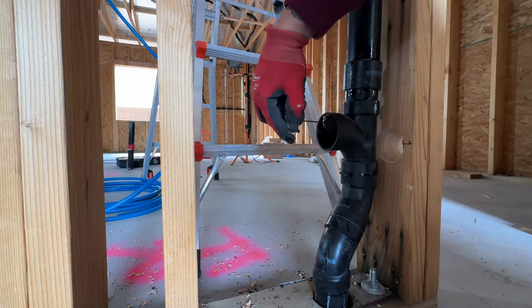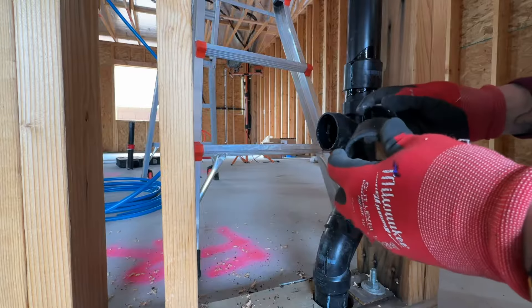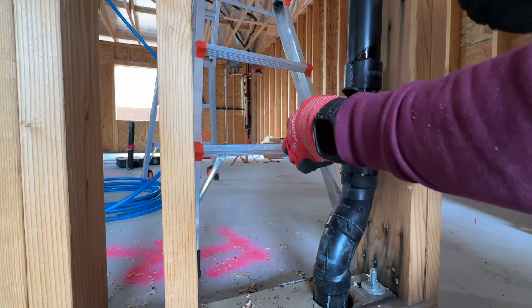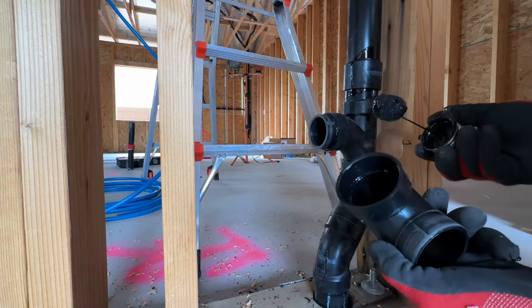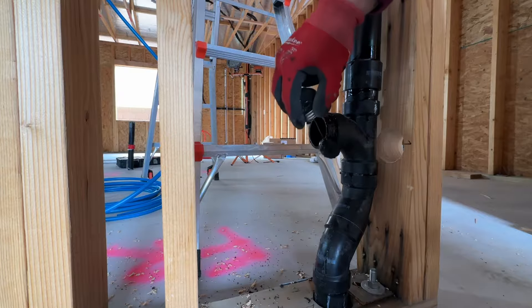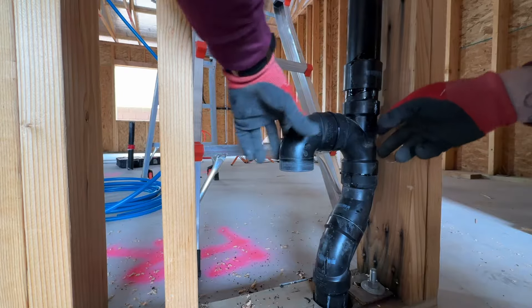Now when I'm cutting this pipe, I'm usually just using a miter saw or a chop saw. You'll see a lot of people use a sawzall or some type of handheld saw, but you never really get those straight cuts. I prefer using something like a miter saw because I can pretty much guarantee that the cut is going to be square. And it really does matter here where I'm trying to get really good fitment and make sure that each of those pipes sits all the way down. So having a clean, square cut edge is very important.